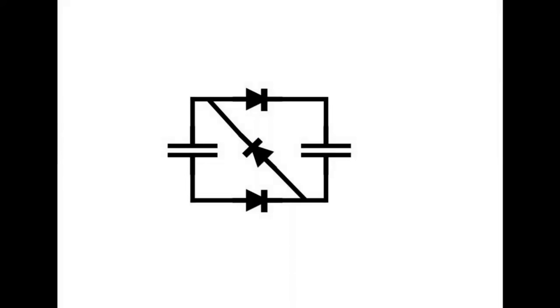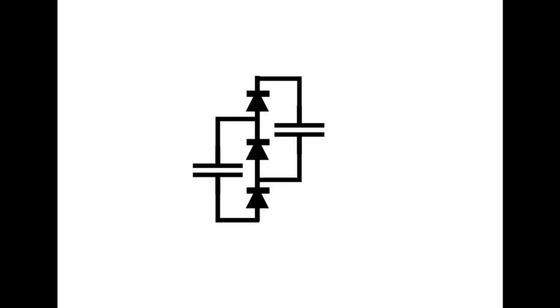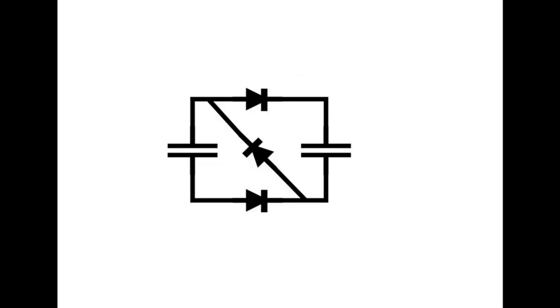To construct this as a fractal network, let's start with the original circuit. If we remove the capacitors and stretch out the diode string, we get the diode string stretched out instead of the Z formation. If we put the capacitors back in place, we get that — and I think that's much easier to follow. What we have here are three diodes in a string with four connection points. The bottom is the negative, the top is the positive, and you can see where the capacitors are connected at those connection points.